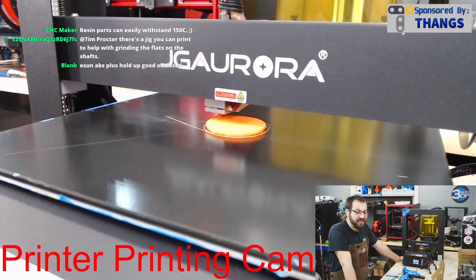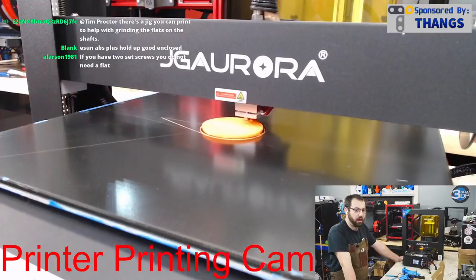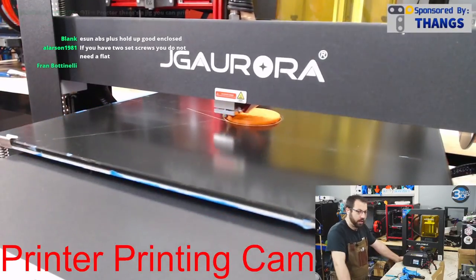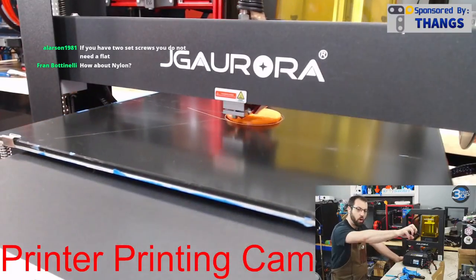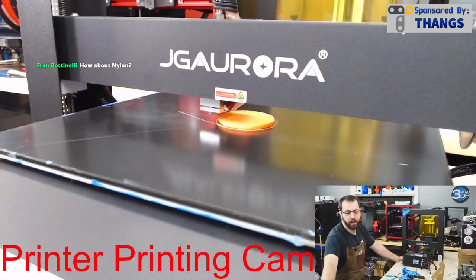The problem with resin is they get brittle. I've seen a lot of people try resin parts on enclosed printers on Vorons and fail. I saw one guy, his tool head, the part where the belt attaches to it on the Afterburner tool head, that whole part just ripped right out eventually. It pulled a chunk out.